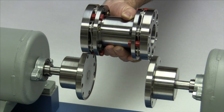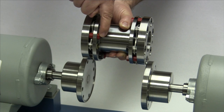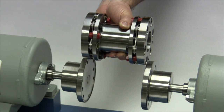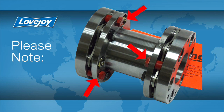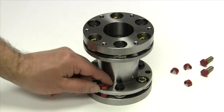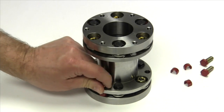The bolts needed to compress the disc packs are provided with new Lovejoy DI style couplings. Many of the larger DI spacer assemblies are shipped with special shipping bolts and sleeves which are typically painted red. They serve the function of maintaining the necessary gap between the spacer and the guard ring, which in turn helps prevent damage from occurring to the disc packs during shipping. Even though special shipping bolts are not normally used with the coupling featured in this video, we want to show what they look like when used. Remove each of the shipping bolts and sleeves, but do not discard these bolts, as we will use them to compress the disc packs in the spacer assembly for installation.